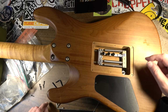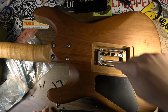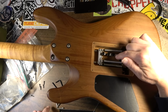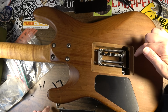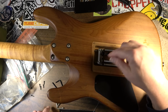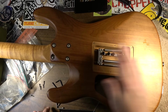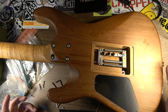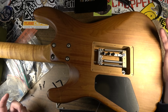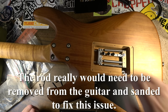Because they're tiny. The flaw I see with this, and the reason I think it has the chatter in it, is when you tighten this down, you're putting little indentations on the shaft. And if those are machined to a pretty tight tolerance, basically you're boogering that all up and you're causing little burrs that are going to then stick inside of there and cause that to not want to slide back and forth as smoothly, especially over time. You know, it would get worse and worse and worse. I don't know. Maybe they sell these little rods that you can replace, and maybe that helps after a certain amount of time. I don't know. But that's just a weird mechanism, dude.